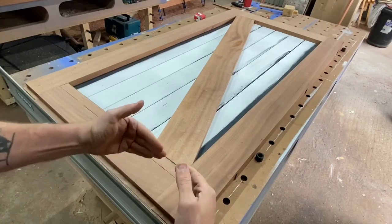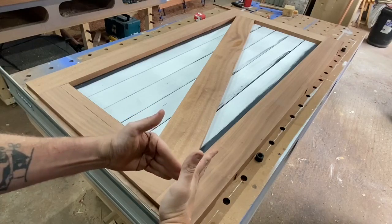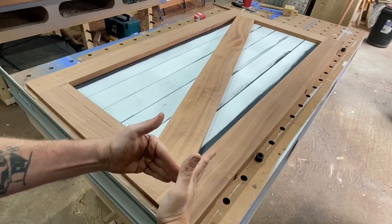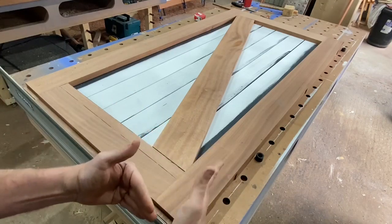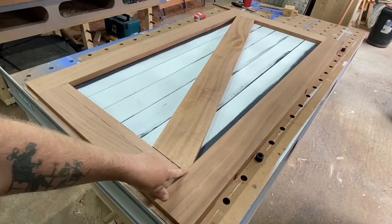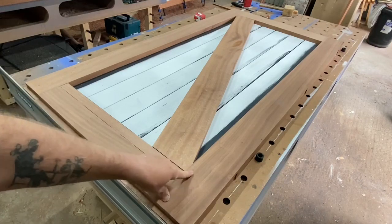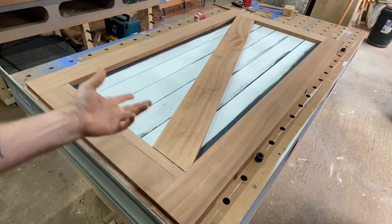And this mortise and tenon, well, it's a domino, but the mortise and tenon obviously is designed to be, you know, if it can be opened up easier than it can be broken down. So we're putting a lot of the weight on there. We are putting some of the weight on there. I guess I could have put a bit more on there, but that's just what I was always shown, 25, 30 mil up. You don't really want to go any more than that.